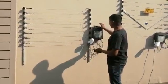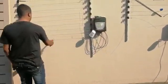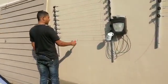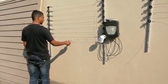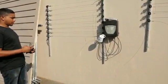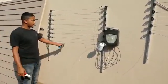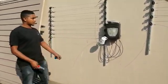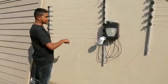I'm now going to cut the fence wire and show you that it will not activate the alarm — same point in the center. Here it goes. One, two, three — the siren does not activate. This would allow someone to get into your property undetected. As you can see, the energizer still pulses, meaning the fence appears to be on.